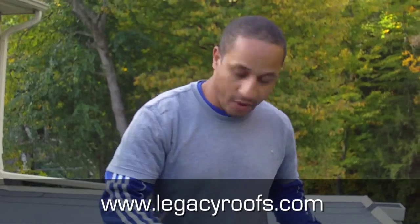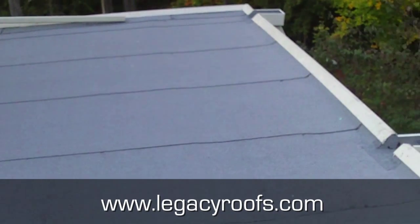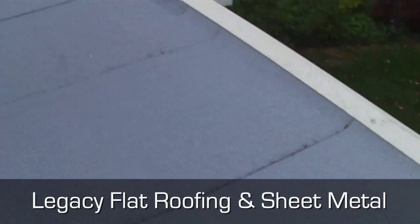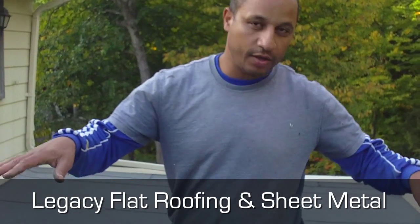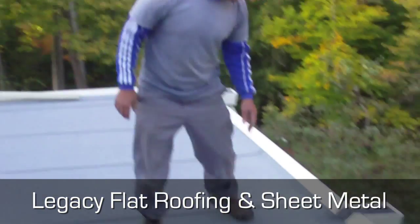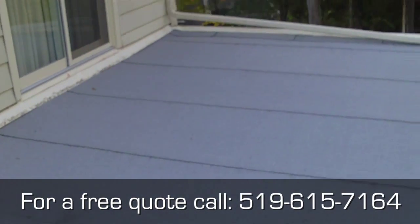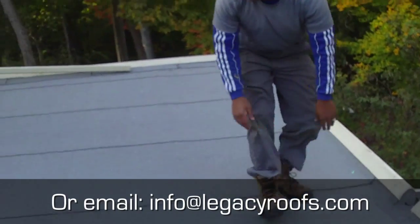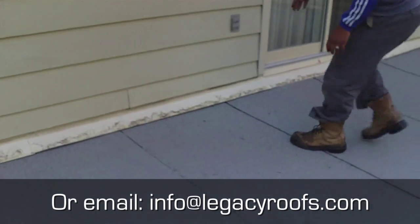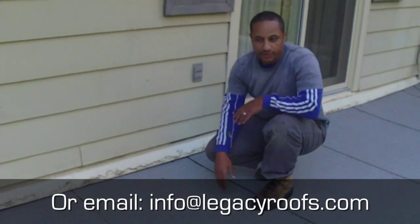It's been a long day and the job turned out wonderful. We're able to divert the water away from the side of the house and get it to the scupper where it belongs. Even with the cap sheet membrane, we layered it in a shingle fashion where the seams are all running towards the scupper. We were able to drop the scupper a good inch and a half and also raise the back of the roof — that's what's creating our slope. We brought our membrane behind the siding, so in the winter when we get snow pileup, it's completely waterproof.